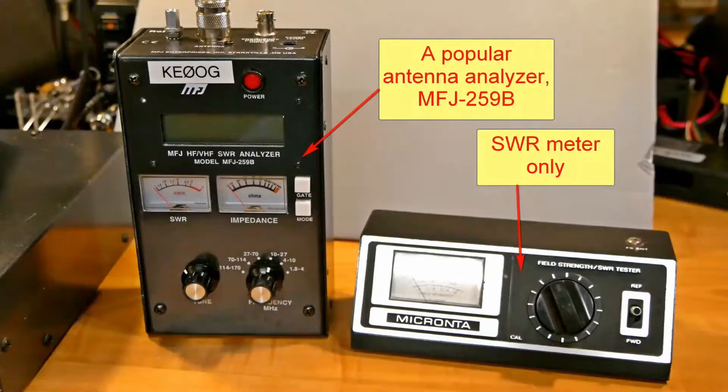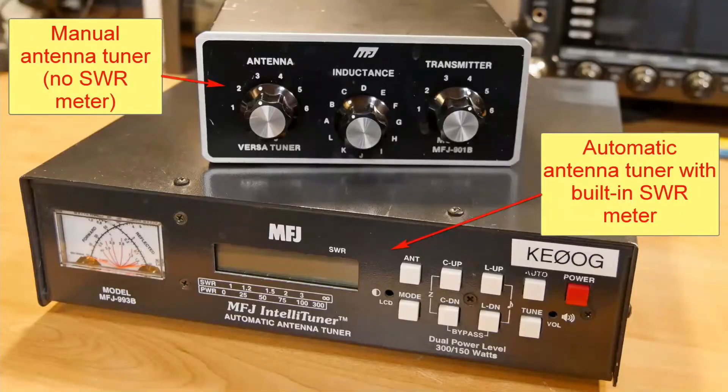It's not such a big deal to get a decent match at two meters, although there are analyzers you can use to check your antenna. Most antennas come to you pre-built and in good shape. If you make your own, like a J-Pole out of some copper plumbing pieces — and a lot of people make their own — you'll need to borrow one of these meters. They're fairly expensive, like $350. Borrow one from a friend and get your antenna set up right. On HF, that's another story. The antennas often don't match. For example, I use an 80-meter full-wavelength horizontal loop as my primary HF antenna, so I need an antenna tuner to match that all up with a transceiver and make everything copacetic.